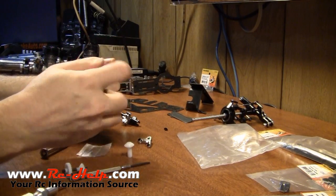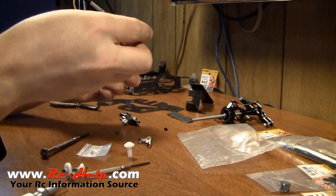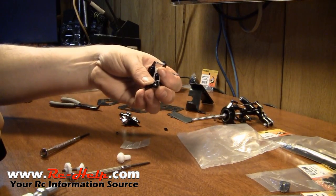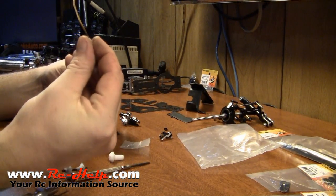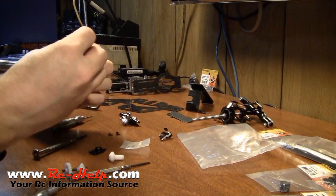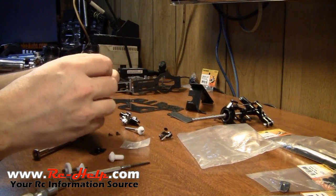Now whenever you pull this apart, pull off the side of the umbrella gear. That way you can just slide this shaft right out. Of course, you've got to thread lock all of this, but one thing I didn't see, there's also a little bitty shim in there. I think that came off right down there. Take these last two out. There's a little washer on there. I don't know if you guys can see that or not. Pull this out. Make sure there's not a washer on the other side. That's just your shim so that you can slide this back and forth, get your gear mesh right.